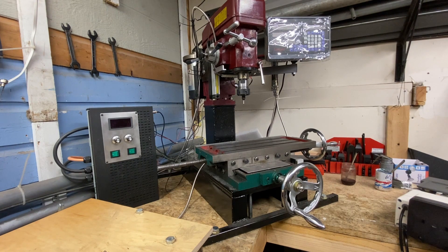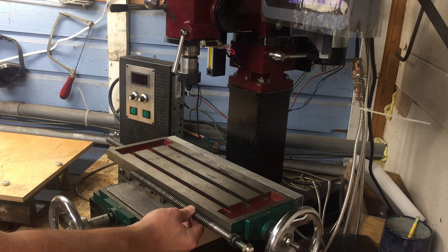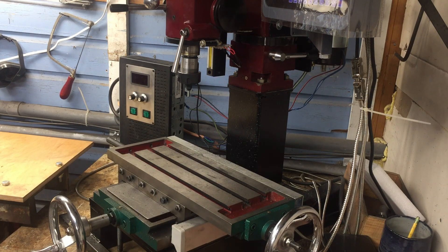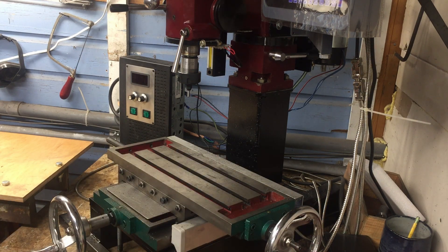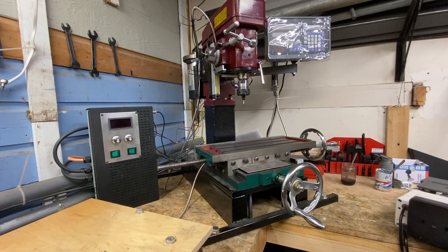Before I could install the power feed I had a couple of issues to overcome. The first was the lead screw that came on this table is extremely short. It ends right there, so it would have taken quite a bit of effort — I would have had to machine an extension shaft. I decided overall it was easier to pick up symmetric trapezoidal all-thread and machine it down to accept the handle on one end and become a replacement lead screw. By going six inches out on this end I have lots of room to work, and it made this install very simple.